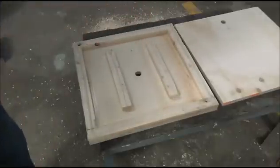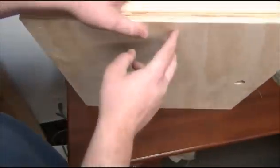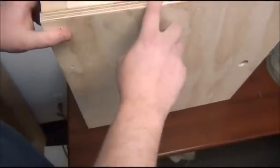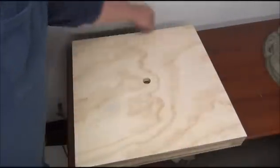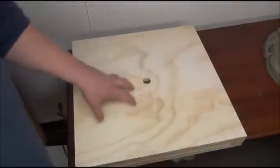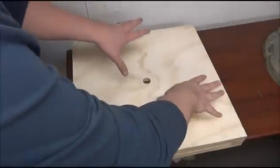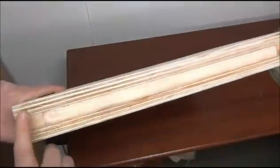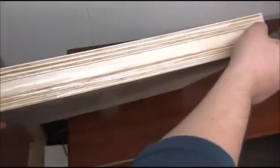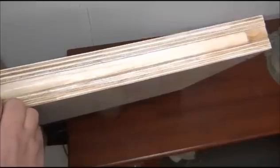Back to the construction of the box: the way this has been put together, we used brad staples and we've also sealed it with silicone. We put down a nice layer of silicone, then put down the sidewalls, put in the baffles — the silicone holds it in place — then take our staples and staple it all together. Then we put another layer of silicone on the baffles and sidewalls and attach the top surface. It's also very important to put a very thin layer of silicone around the very edge of the box, because if there's even a pinhole you can lose quite a bit of vacuum and won't get a very good part.